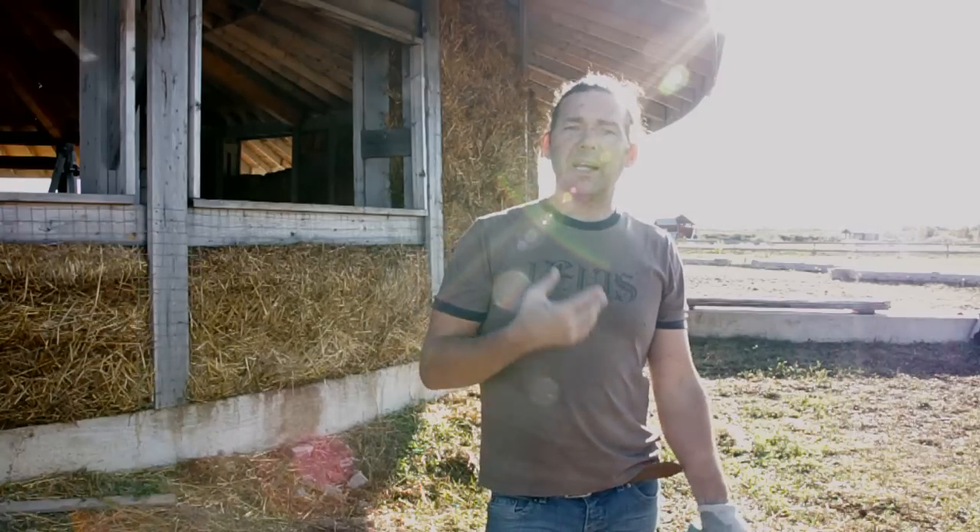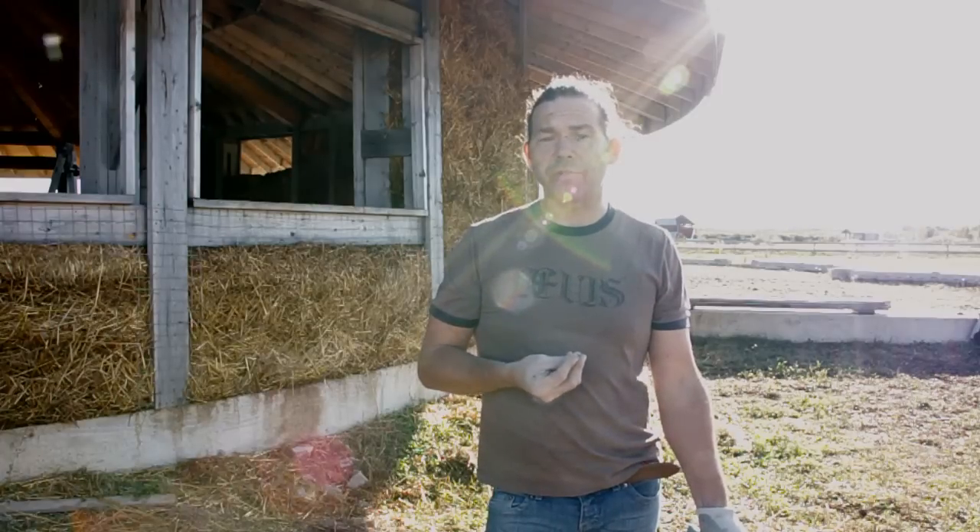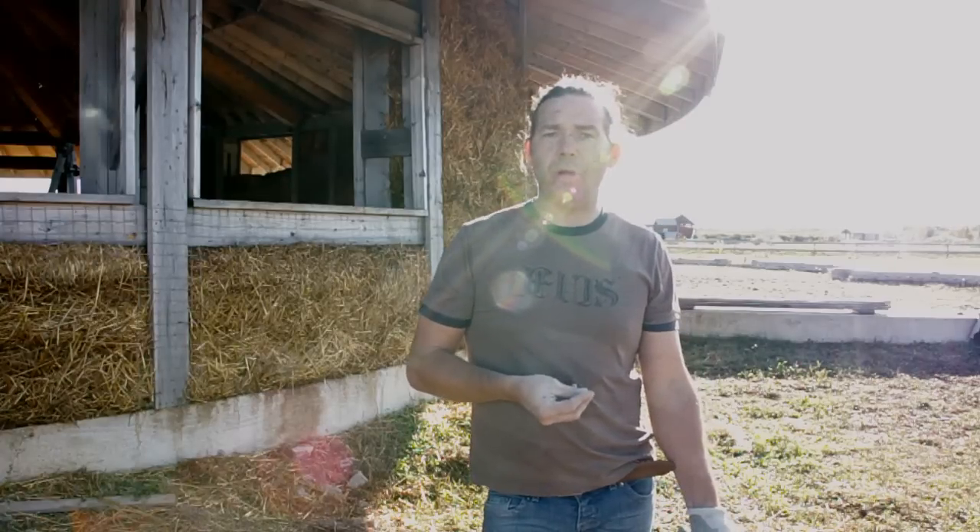So make sure you wet all your tools down before you get going. The other thing is, any of the surfaces that you're going to be putting stucco on — the straw is dry, so it's going to suck all the moisture in from the stucco and cause it to crack immediately as it dries out. It's going to dry way too fast and give you a soft crumbly surface. You want wet bonding to wet — that way it takes a little longer for the lime and the cement to set up and gives it a good time to solidify. So make sure you wet your surfaces down with a good amount of water — not enough to wash the straw out of your walls, but enough that they're going to stay wet for the next couple of hours.